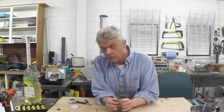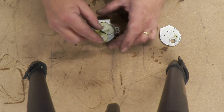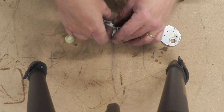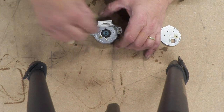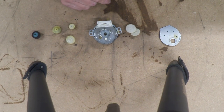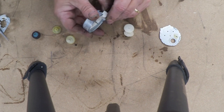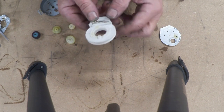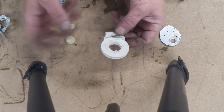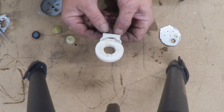That was not the world's strongest magnet, but it's really interesting that we can magnetise it. Now let's build something to hopefully make a stronger magnetic field — that is a magnetiser. To do that we're going to use this: a synchronous motor from a microwave oven. If we flip the top off — held on by four little lugs you bend back — you can see a whole load of gears. Those gears come out just by flipping them out, and then in there is a small magnet on a pin. Underneath that section is a coil — a 240-volt coil, which will depend on your country's voltage. This can be the heart of our magnetiser.